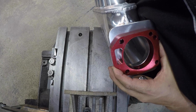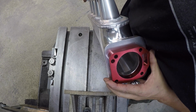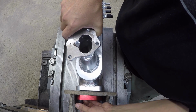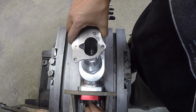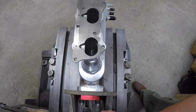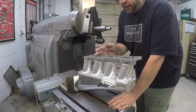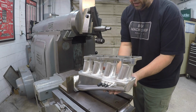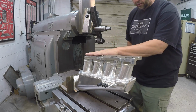I got the hole pattern set right. Actually, I think I got it reversed. This is sort of an odd bolt pattern here. Got to get it lined up just right. So we go through that hole. What we'll probably start with is we'll go ahead and run an indicator across this direction right here to make sure that we have it rotated this way correctly, and then get that snugged up, and then we'll get the outer end supported properly, and then start doing our indicating by rotating or tilting our table, should I say.